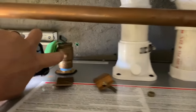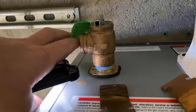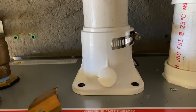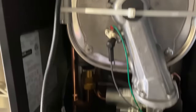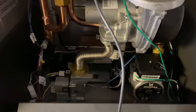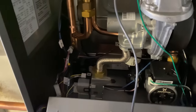Let's start at the top of the unit. We have our male connection coming out of the top left — that's for our relief valve. And then we have our exhaust coming straight out of the top with a combustion test port. There's our fresh air intake. Top of the heat exchanger. The bleeder hose to bleed out the heat exchanger — very, very nice touch. The part I really love about this is that you can just easily pop this bad boy out and expose all of the components: your circulator, three-way valve, gas control valve, all that good stuff right here. Sensors. It's beautiful.